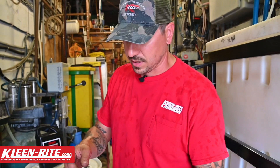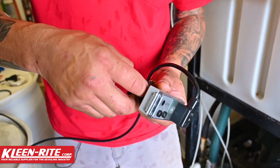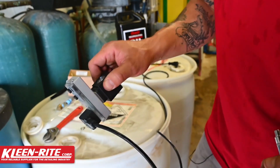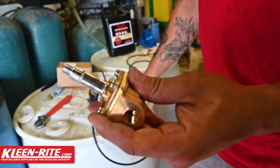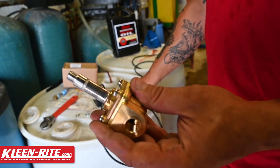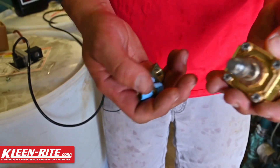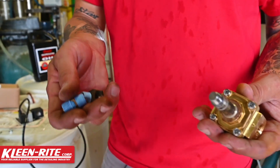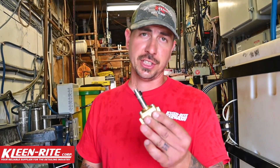To install this, grab the top nut on the mag head of the solenoid and remove it along with the spring washer, the timer mechanism, and the mag head itself — leaving just the valve body, which makes installation much easier. I'm using a 90-degree fitting and a nipple to configure this into the valve on the bottom of the compressor. I cannot stress enough: leave the manual ball valve on the compressor. You always want a manual shut-off in case this automatic valve fails.